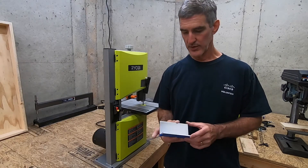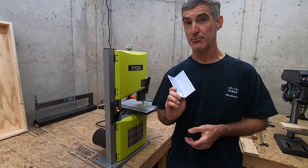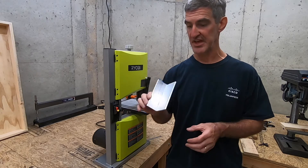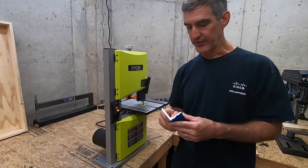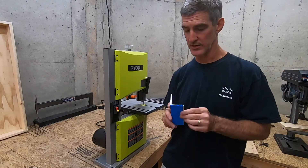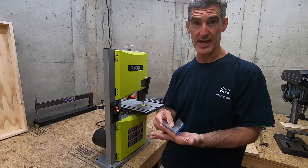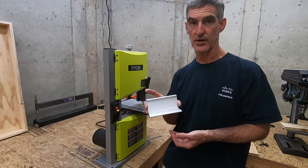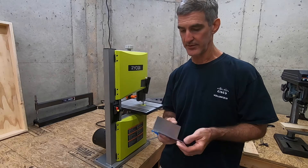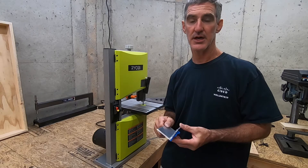I'm going to start fabricating the horizontal stabilizer mounting brackets out of this piece of aluminum angle stock. This is AA6-187, two inches by two and a half inches and five inches long. I've got to fabricate a left and right mounting bracket out of this stuff, and you can only get two parts out of it - there'll be a lot of material cut away.